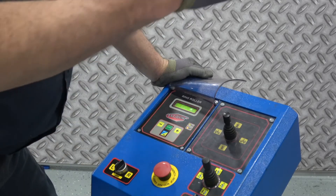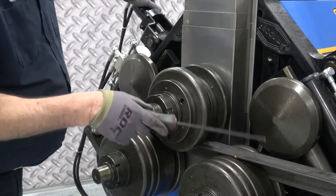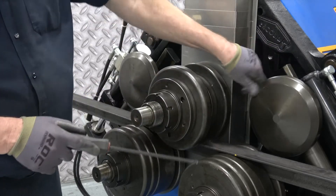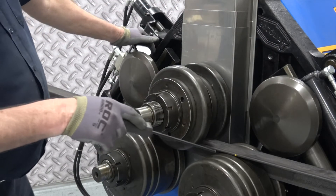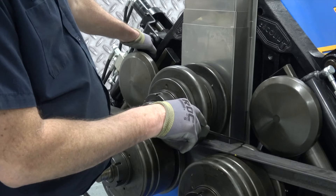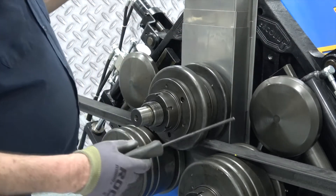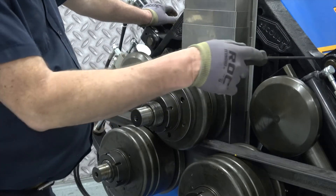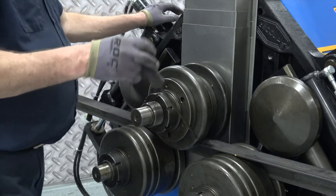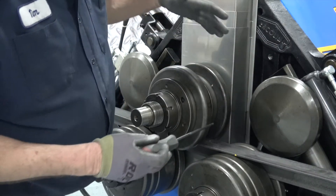This is all done after you stage your material in the tooling. For the C70, we have two and a half inch angle iron, leg out, quarter wall. On the machine we have to put the conical washers right and left. Then we stage the lower two spindles with the supplied larger diameter spacers on the shafts first — that's to support the back side of your angle and allow the correctors to have reach in and out. The bottom is just flat stage. At the top it's what we call saddle grip — it allows the U-shape to grab over the channel and actually make the bend.